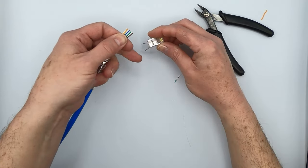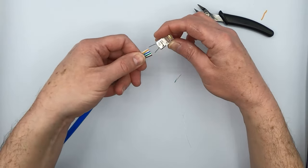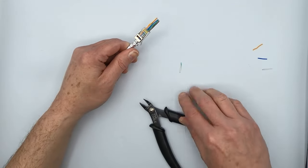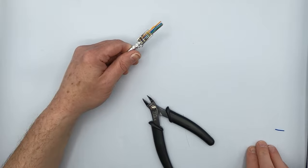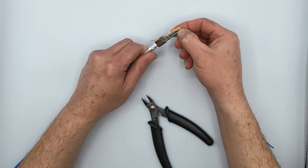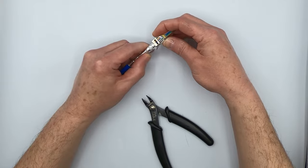With the plug flat side up facing you, put the white orange in from the top and the white brown will be at the bottom — that's for the B sequence. Once you start putting them in, they're going to automatically stagger for you. Reconfirm that the conductors are still in proper order once they come out the nose: white orange, orange, white green, blue, white blue, green, white brown, brown — and they are still in the correct order.